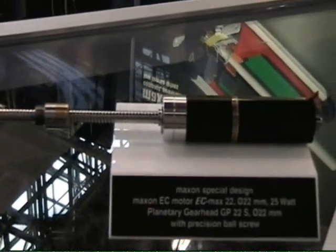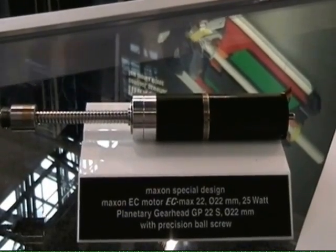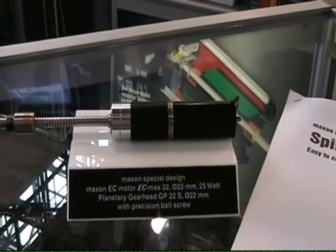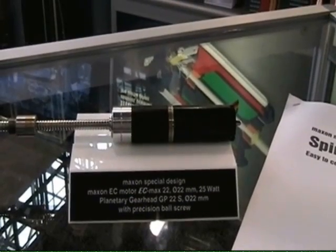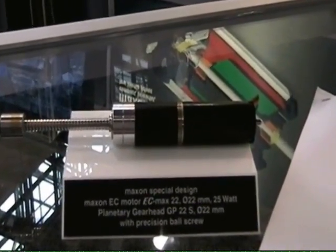What you're looking at right now is a 22mm solution. It's a ball screw. It's available standard at a 2mm pitch, but a custom solution is possible. We could do a metric thread. We also have the ability to offer various flange nuts with various mounting features.